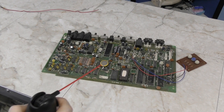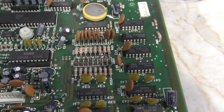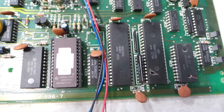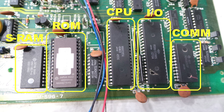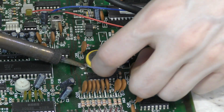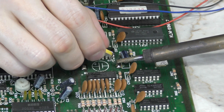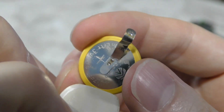While waiting for that to dry, I turned my attention to the logic board. First I hit it with some compressed air to remove most of the dust. The main CPU is an 8085 — the same chip used in many of my Yamaha keyboards and several personal computers from the 1980s. Next to that is a general purpose I/O controller, an EEPROM, a communications chip that I think probably runs the MIDI ports, and a 4KB SRAM chip that holds the program information powered by the backup battery. The battery is in a weird position — it sits up above two chips on either side rather than flush with the board — and I'm at a loss as to why they designed it that way, knowing it would need replacing every few years.